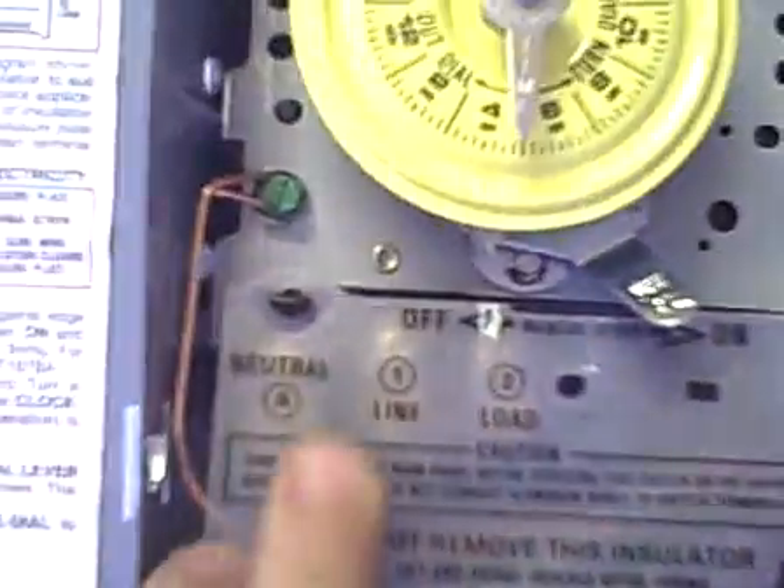There's the load side wire. We'll stick the other wire back on the same breaker — it becomes the line side and feeds the clock. We brought a neutral from the neutral bar over to the neutral terminal, and a ground wire to the ground screw.